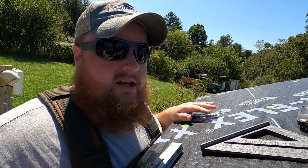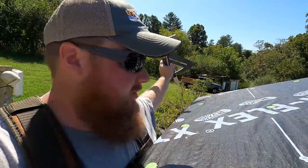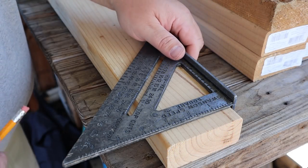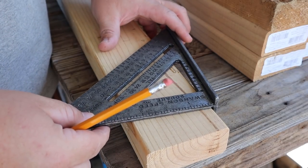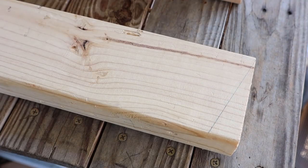With the roof pitch confirmed, I'll go ahead and measure my eave overhangs and start framing these up. Here's how to transfer marks from a speed square to a piece of wood using common rafter pitches: put your pivot point at the 90-degree on the right side, hold it, and pivot until the mark for your number lines up with the top edge of the wood. For lots of cuts, a bevel gauge cinched down tight is faster and more consistent.